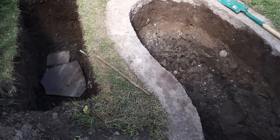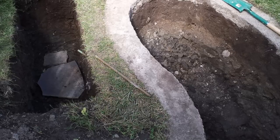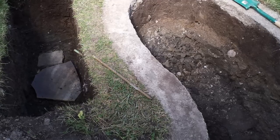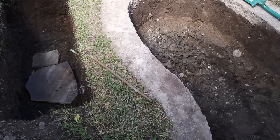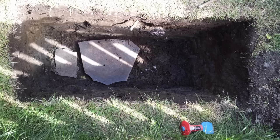So now we're ready to start connecting from the pond to the filter pit. What you're going to do is you're going to have to tunnel about a three and a half inch channel to go from the pond on the right to the filter on the left. You see that metal rod on the ground? That's about the line that I took. Now my drain is about five feet down and it's coming all the way up to one foot in the filter pit on the left hand side. Here you see at the top of frame where the metal is just poking through. That's where the channel comes out and that's where my plumbing will enter into my barrels, which I'll show you shortly.